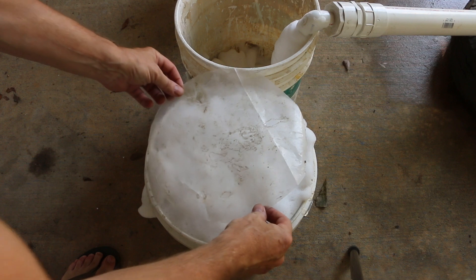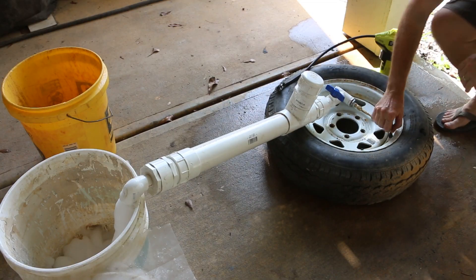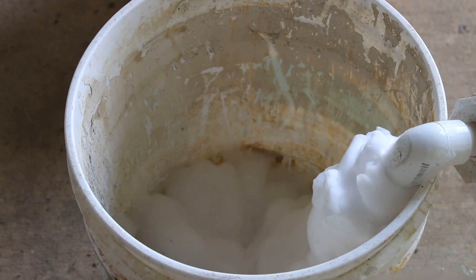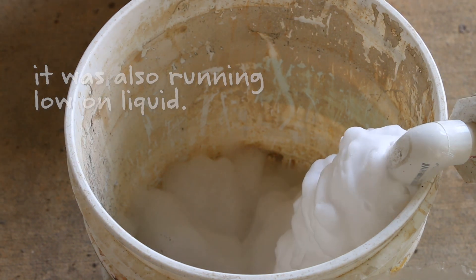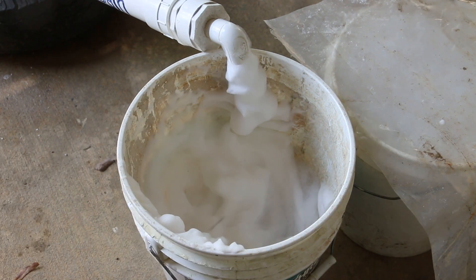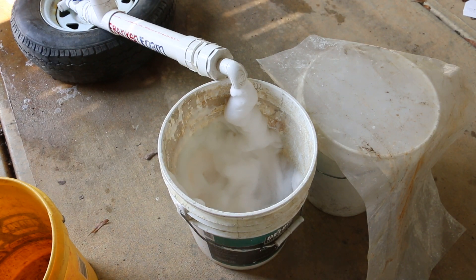I'm going to cover the first bucket with this piece of plastic to see if I can make those bubbles not break down as quickly. I only went up to 30 pounds of pressure this go around, and you can see that the foam production is definitely slower. This is slowing down again, so rather than re-inflate the tire a third time, I'm going to drain what's left in frankenfoam and then interpolate the results. Right now I've got about seven and a half gallons of foam — a bucket and a half. This would be fine for most of my projects; I would probably only need two to three gallons for how much aircrete I mix up in a batch.